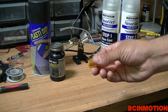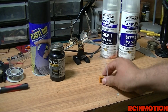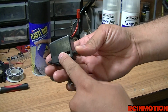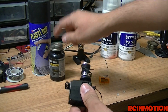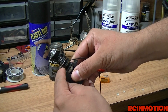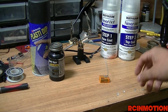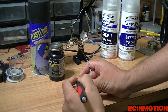There's also something called conformal coating. With conformal coating, you just coat the outside or wherever there's exposed electronics so that water doesn't get in. For example, on a servo — imagine this hole is here — you'd wrap a coat of liquid tape around the bottom edge and right at the top where the horn goes. That's conformal coating: just covering any entrances where water can seep into your electronics. Here at RC in Motion we hardly do conformal coating, but today we are going to waterproof this — let's open it up here.